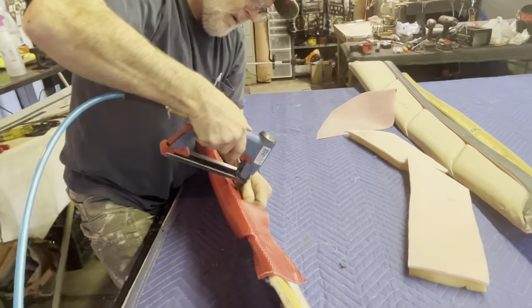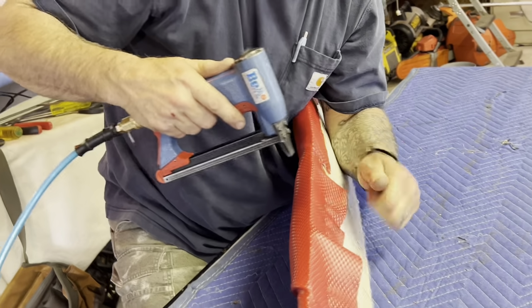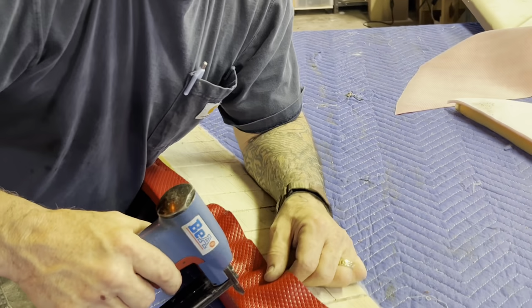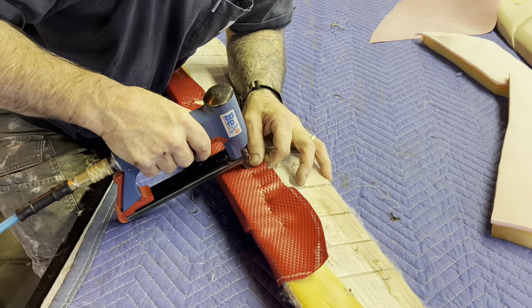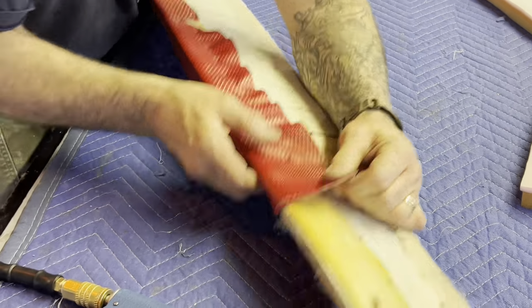Start in the middle, bam, bam, okay? Then come back to the edge, bam, bam. And you can push and pull as you go and you staple. See that? That is perfection. Come in the middle, then go over to the other side and work your way in. Middle, middle, and on ends, don't distort,